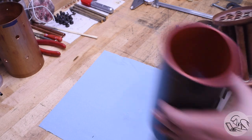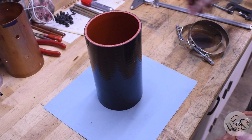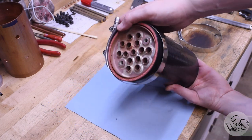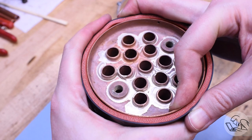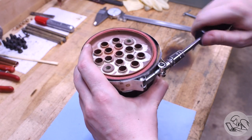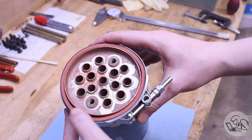The next idea was high-pressure silicone tubing, used for plumbing turbochargers in cars. The good stuff is rated to 250 psi — be careful because there are a lot of knockoffs rated as low as 40 psi. The four-inch diameter might be perfect to wrap around my core, and it comes with nice fully sealing hose clamps. This kit was $15, so I figured what the heck. I tightened the clamp down but it was clear it wasn't going to work — the tube was buckling and just wouldn't fit. So it was worth the try, but on to Plan B.